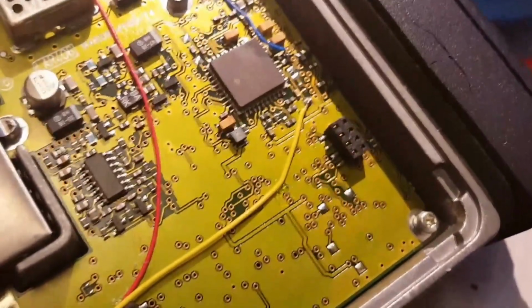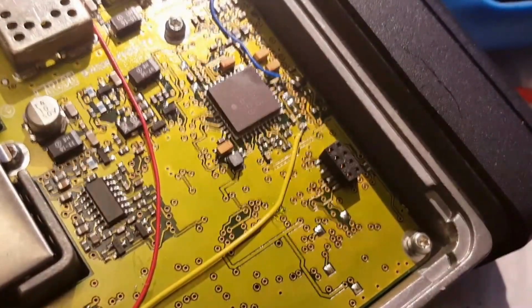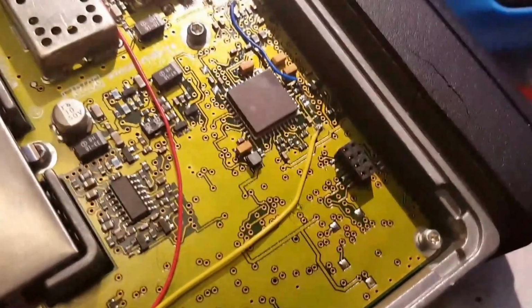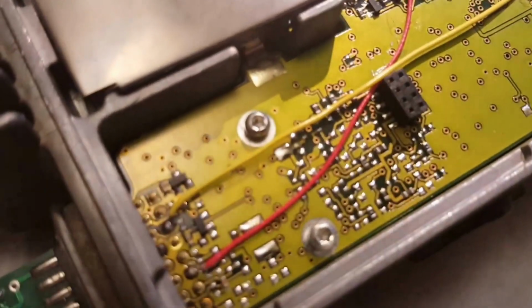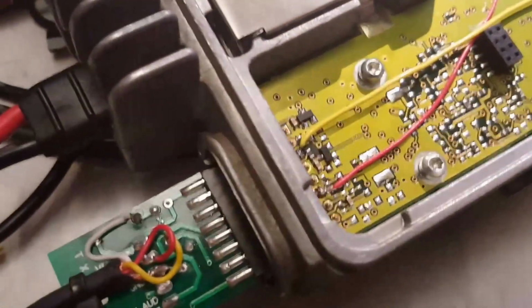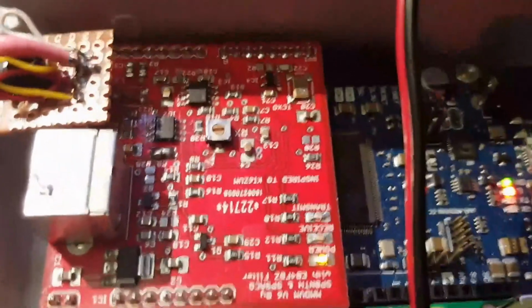This works, and it's working very, very well. I'm really pleased with it. Really nice, clean signal from the test signal being fed into this point. It requires a fair amount of drive to get this into work, so there's no resistor or anything needed. I'm just coming straight down here. I'm using the correct pin 5 on the socket there, and then that gets routed into the SP8NTH board.